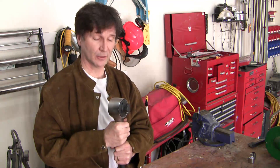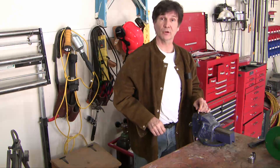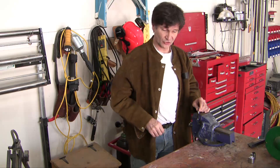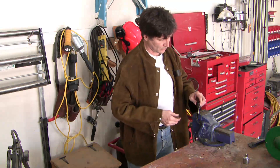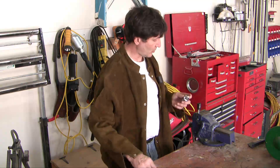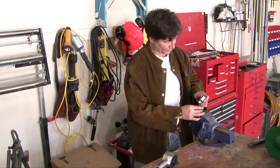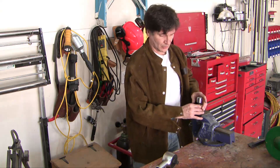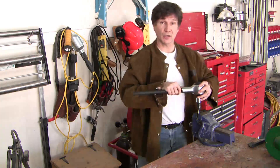So I'm going to show you how it works here. I've got on my bench a bolt set up, and we're going to say it's frozen. So how do we get it off? We'll put a socket on the bolt — as it turns out this is a three-quarter drive and my socket ends up being a half-inch drive, so I'm going to use a converter and put on our torque multiplier like this.